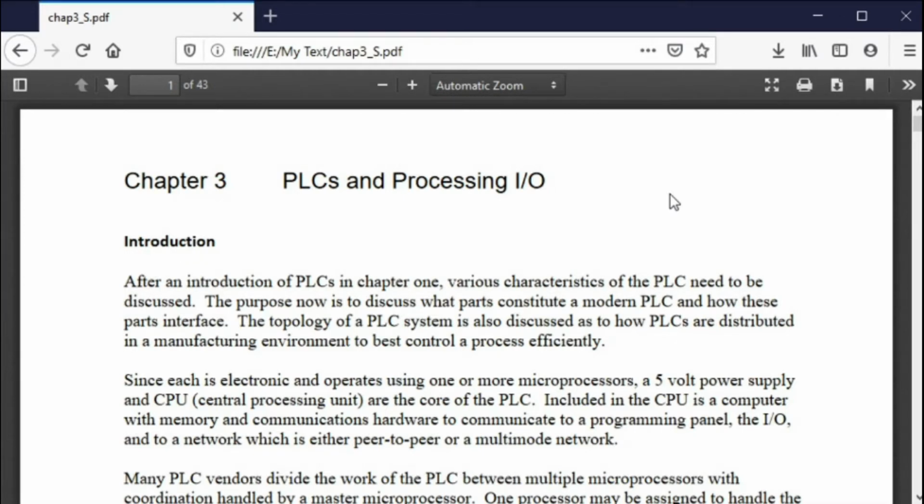So relays are asynchronous, so basically you cannot control the speed at which one versus the other turns on, so you can't do the sequential nature of programming like you can with a computer. So you can use the programmable controller to do a lot of things, and it can be useful for any kind of control, and it's especially useful for factory floor applications.